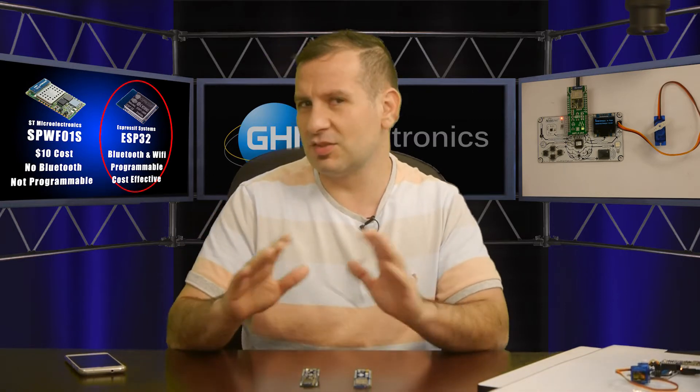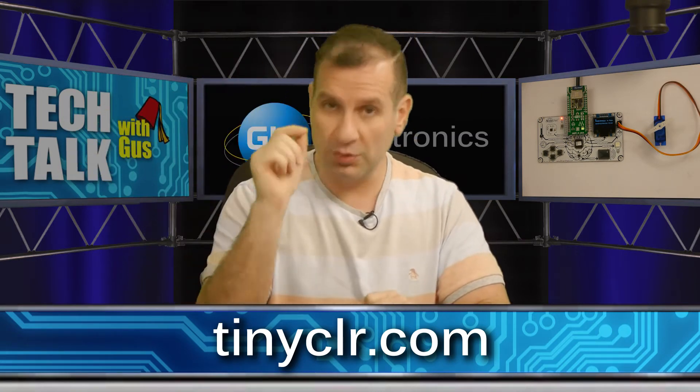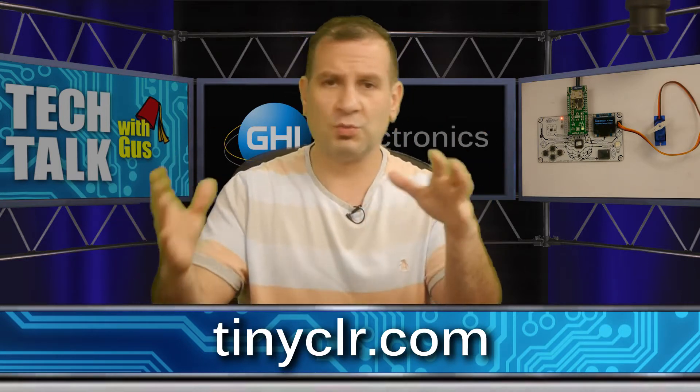So we went with Espressif. We put it on a circuit and started working with it. It is programmable, which is nice if you're building really small sensors — it's even supported by Arduino, so you have a free IDE and can load your program right onto the Wi-Fi module. But this fits very small sensor-type products. We want something with more power behind it, like TinyCLR or mbed. Also, keep in mind: this is focused on a commercial customer, not a hobby project. You have to know your end goals and target audience.